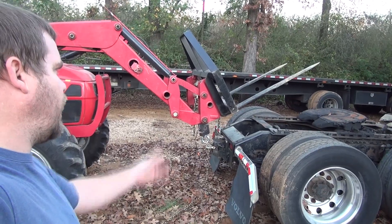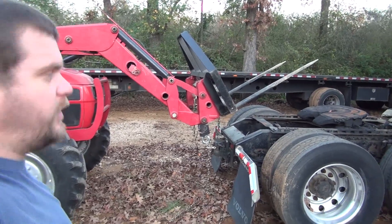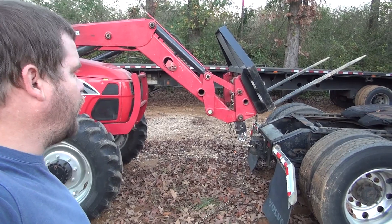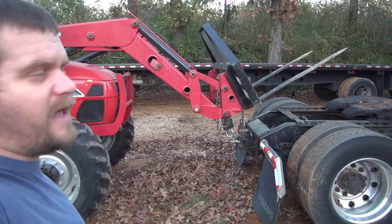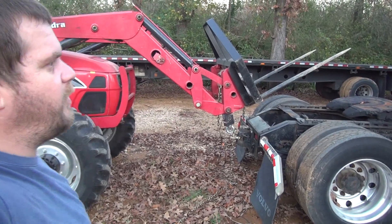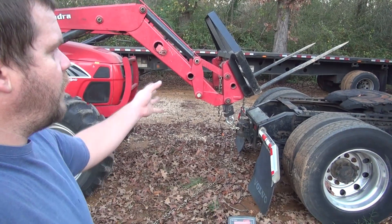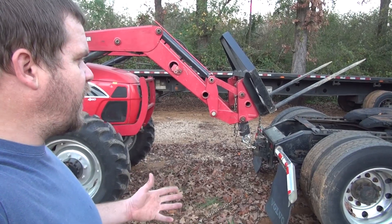There's definitely some options there and you can do a lot with a tractor this size. I would not want to drive it anywhere with that kind of weight out there — it's a lot of stress on the front axle. I wouldn't want to go very far. But as far as unloading something heavy off a truck or moving something at very slow speed across the yard, I would be pretty confident I could pick up two tons — 4,000 plus pounds — off that flatbed and get it moved where I need it to go. Once again, I have increased the hydraulic pressure up about 10% on this particular tractor, so it is a little stronger than a factory tractor of this size. With that being said, thanks for watching — we'll see you guys in the next one.